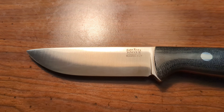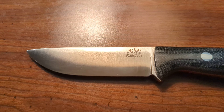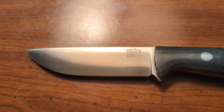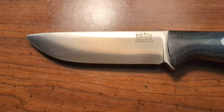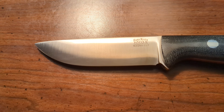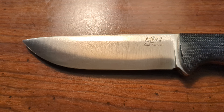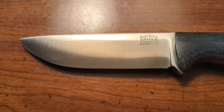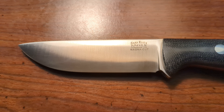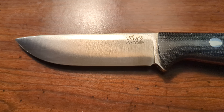However, that's DLT telling me, and they suggested I use Flitz. But I kept having this nagging feeling because I have a lot of Bark River knives and none of my 3V knives had ever come with any kind of patina from being contaminated with other steel. They acted like 3V and kept their shine as long as 3V should, and I never had a problem with them. So I was wondering - why is that? I've got eight 3V knives, and if Bark River grinds everything on the same belts, then why did I never get a 3V knife that had any problem?